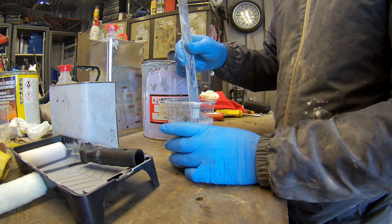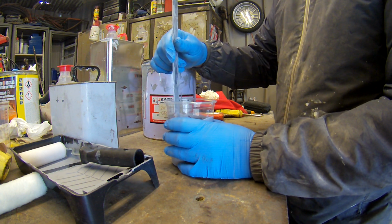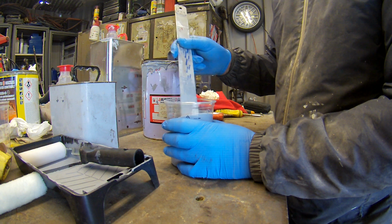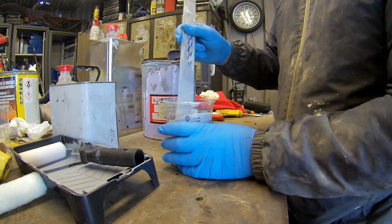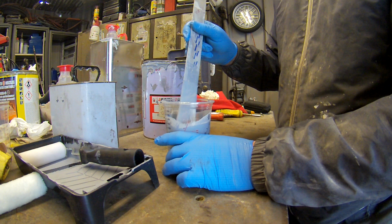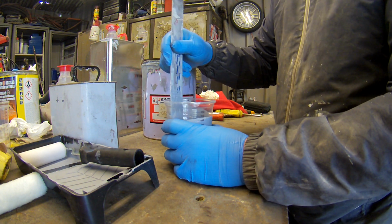And then spray the last light coat of primer on, and then 320 or 400. That's all I do. Like I said, this is 4-to-1. Any spray jobs, 2K is 2-to-1, or base coats, sadly, everything's 2-to-1. This is a primer because you want it thick. It's 4-to-1.